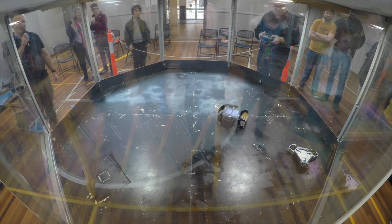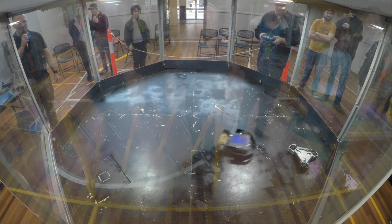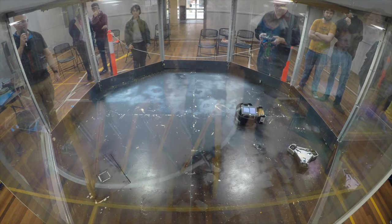Turns out the power switch that I'd made from a screw and two copper plates had an intermittent contact issue, and just about turned off when it got hit. Poking the switch, just tapping it to turn back on, so pretty much at that exact moment, I vowed to use proven off-the-shelf parts for something so critical as a power switch, and not to bother with making my own again, just to save a few dollars.